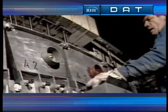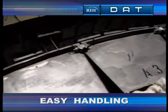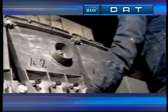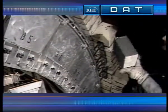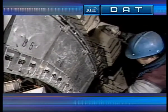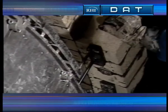Now the ring is self-supporting. After air has been evacuated from the cylinders and the formwork arc has been moved on by one layer of bricks, the back row of cylinders supports the ring that has just been installed but not closed. Now the ring is closed with a suitable combination of key bricks. The cylinders can be controlled individually. At the same time, the next ring of bricks is pulled up with the front row of cylinders. Direct monitoring of firm ring fit is possible after wedging.